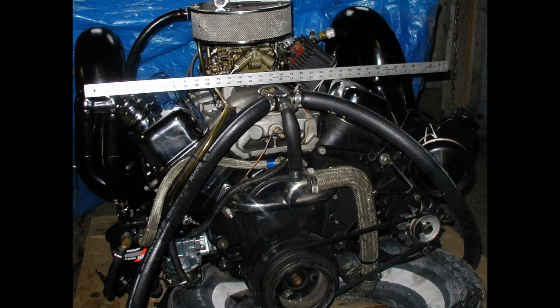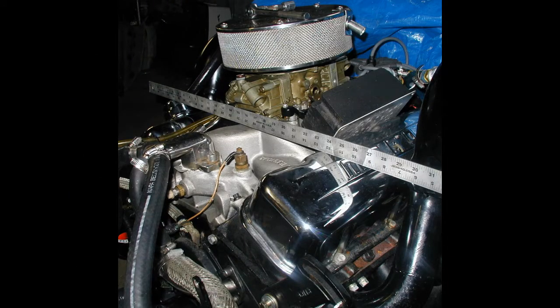The only thing that happened was it was modified slightly — lightning. The original exhaust was a water-injected header that rusted out, and I replaced those with a first-generation Lightning tubular header that later went to the full water-jacketed tubular headers. Now this engine did have its problems. It didn't have a sealed transistor ignition in a marine environment. The old Lightning headers are a steel header and they leaked — basically rusted through in several areas.